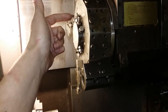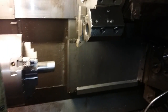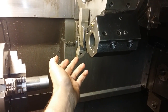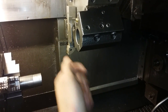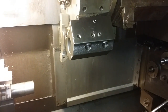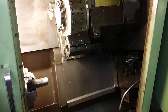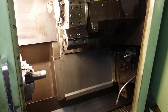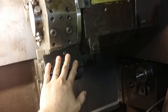But when the adjustment is off radially, what's going to happen is all of your tools will be offset, off center, I mean. So all of these OD and ID tools, and also drills and boring bars and everything will be off center. And in my case the error was about 0.5 millimeter, which is just too much for drilling. So some error you can compensate by leaving out these pins and just tapping the holders, but that's not a very good way to go.